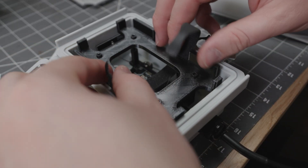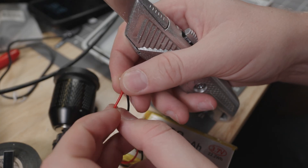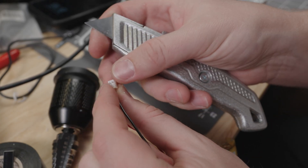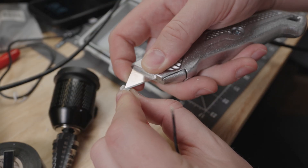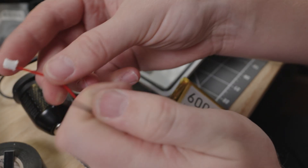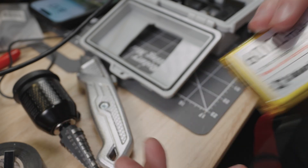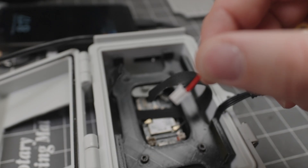This part is very important — a lot of batteries come with reverse polarity. You want positive and negative to match what your Meshtastic node requires. In this case you need to swap the left and right terminals around. This is critical — if you get it wrong you will smell magic smoke, meaning you just fried your node. Make sure red and black align with what's labeled on the node.